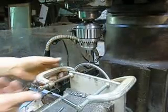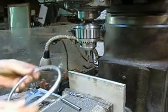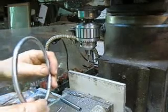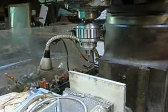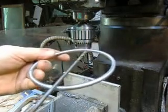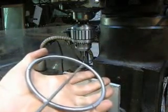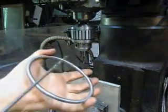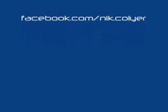So now we take those little plugs that I talked about and we're going to weld them — we may braze them, I'm not sure yet. We're going to weld them to each of the rings so that the rings are parallel with each other. We've got to come in here and knock out that burr right there. I think what we'll do is come in with a regular hand drill and zip that out using an extra long drill bit so nothing gets in the way, and just clean up that edge.